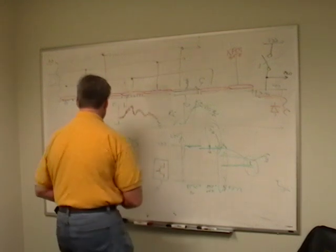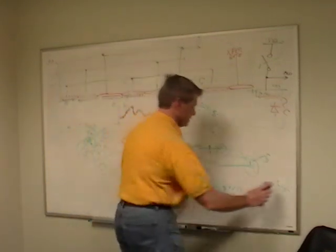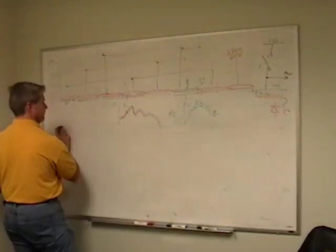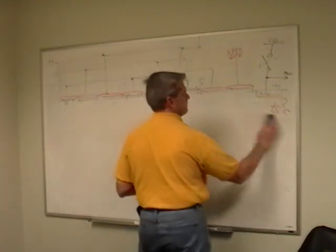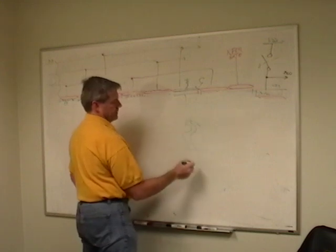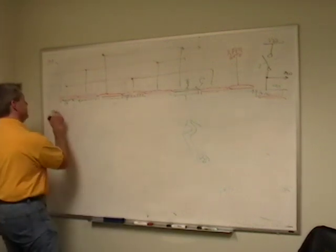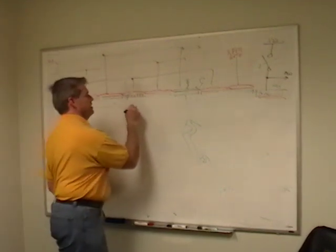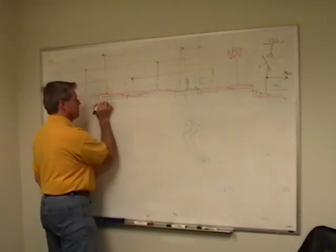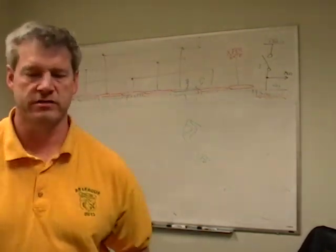So one of the other things you can do is you can illuminate this from the back. So it's called a backside illuminated CCD. Let's erase all this garbage. And you can send your light in this way. So your photons are zipping in from the backside. But to do that, that means you have to thin this. So you have to backside thin all of this, because these wells are really shallow, right? We talked about that. We're talking a couple of atoms deep at the most, maybe.